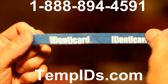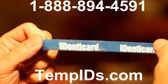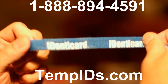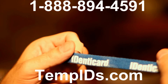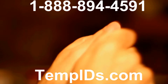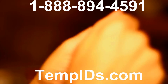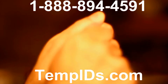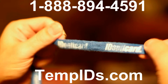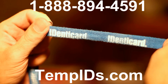Next up is silkscreening. We offer silkscreening, but this is not one of our jobs. We wanted to show you this as a comparison because this other vendor insisted that this was a silkscreen job. With the silkscreen, it's a brighter pass on the fabric. We believe that because they used a poor quality material to print on, that's why this happened, because with silkscreening the imprint shouldn't just flake off so easily. With the rub test, you can see that the image comes off fairly quickly — and that shouldn't be the case with silkscreening.